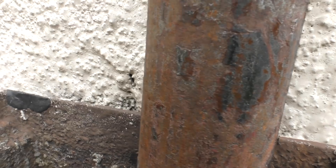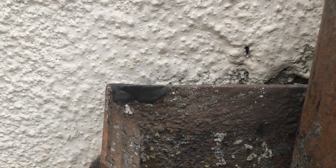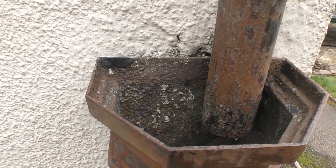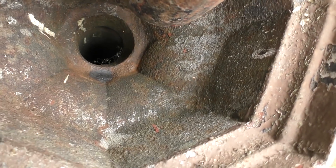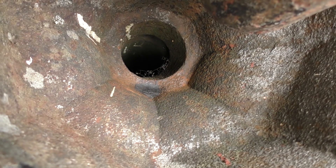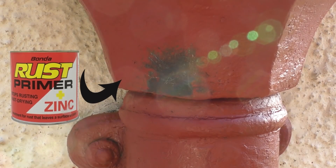I'm going to be really interested to see how this repair works. It's not necessary for the operation of the hopper, but as you walk down the drive you can see it quite clearly. It probably won't be that strong, but once it's painted you'll never know that chip was missing. So that's repair number one done - it'll set in three to four hours without shrinking. Looking inside the hopper, that is the repair from the inside, so it should be a really strong repair because I'm layering up on both the inside and outside.